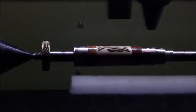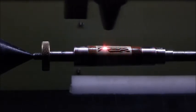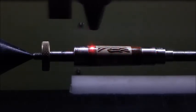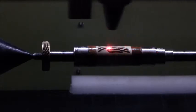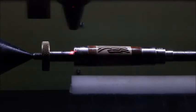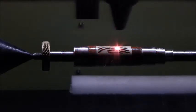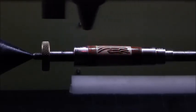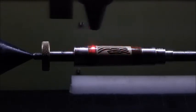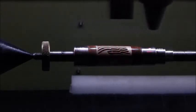For those of you wondering, scan gap is, as it's rotating towards the camera, the space in between each time it cycles left to right. So it'll cycle left and right, left and right, and it's how far it moves the workpiece before it zaps it again with the laser. The closer in the scan gap, in other words, if it was 0.1, it moves 0.1 of a millimeter. I turned it back down to 0.05, so it's taking off a lot more material, a lot more accurately.